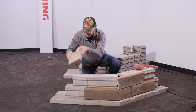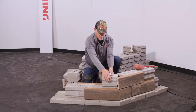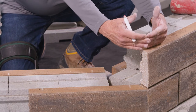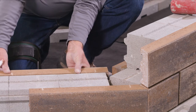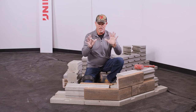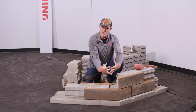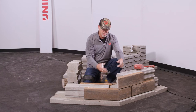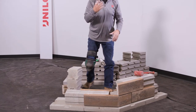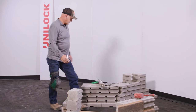I'm going to disassemble this really quickly just to show you the inside, and the inside is fairly simple as well. So no cutting here on the backer — all the cutting is on the outside facial panels — but the inside backer is simply a full panel to a half panel, and where those meet, that's it. Structurally, we have things enhancing the support of this corner in the interior with the backers, and we are mitering up those exterior panels. So it's real easy to provide a strong installation on a 45-degree angle, or any angle really.